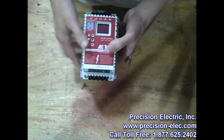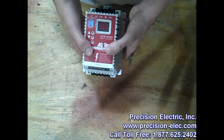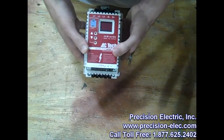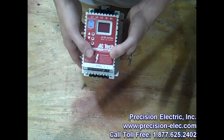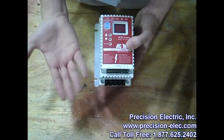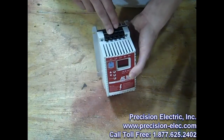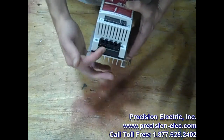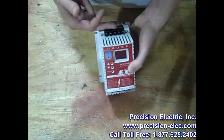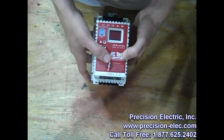This drive in particular is the SCM series — the 'basic and beyond' model, as they call it. It's feature-rich for motor control applications that require variable speed in standard volts per hertz mode, and cost-effective enough if you don't need to vary the speed. For example, if you just need it as a phase converter, you bring 120 volts into the top as your input voltage, and you bring your motor leads out the bottom at 240 volt three-phase — single phase coming in, three phase coming out.